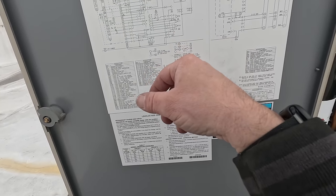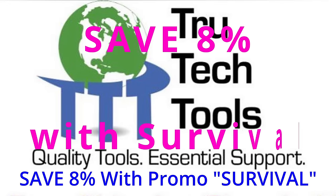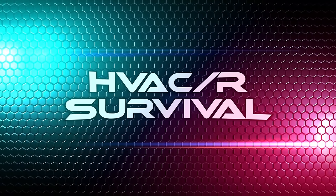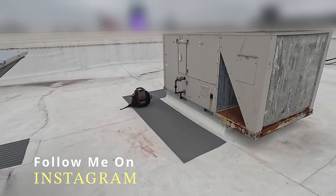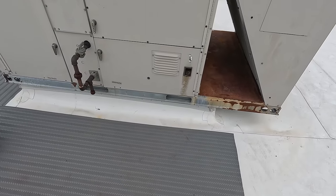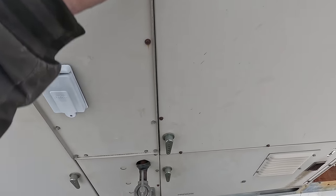Why ones and twos? This video is brought to you in part by TruTech Tools — quality tools, essential support. What is going on, guys? So we have a no-heat call here to run. Just got on the roof. D1 here is the one that wasn't at temperature; the other ones were. I can smell gas pretty strong since I walked up to it, so it's not firing off.